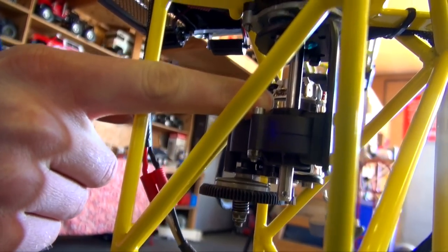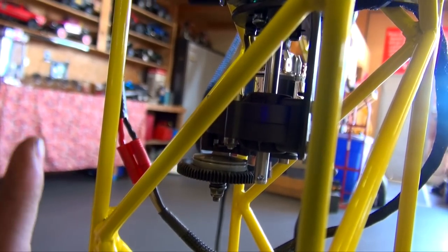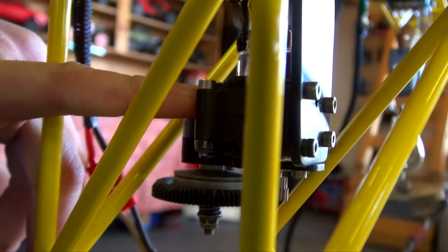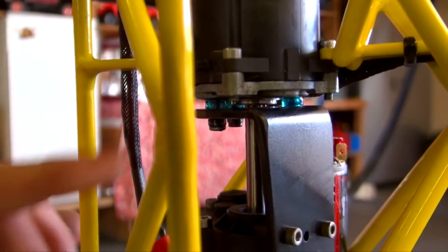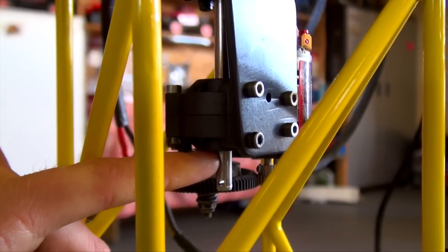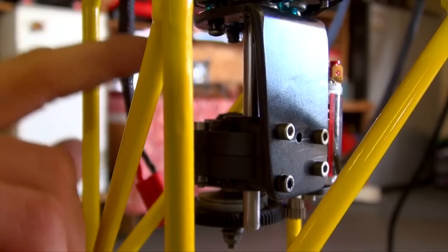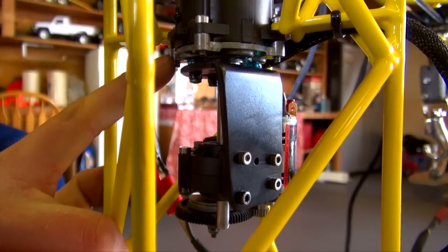I think these ones are steel. I drilled them out to exactly six millimeters and got them just about straight. The top one is like half a millimeter out and the bottom one is perfect, so I had to rubber-mount it up here because it has a tiny wobble. Then I drilled a hole straight through the shaft down in the transmission, ran a pin through where the bearing rides, and the bearing actually captures that pin and holds it in place so that as it turns it's never going to move. This plate was designed just to mount the transmission — it's not the original plate off the motor, I ended up breaking that because it was cast and cast isn't super strong when you take all the other structure away from it.